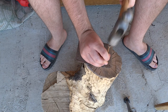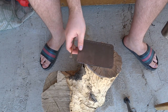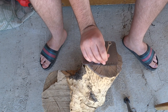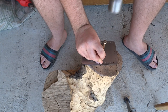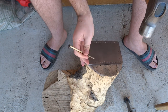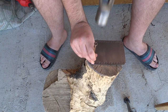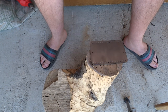After I cut the metal bits, I mark them and make divots where the mail would go in later on. I make divots so the drill head doesn't slip off and make holes centimeters off, because each hole needs to align with the mail and the other plates. So I need to be exact in this situation, and I make a prepared hole for the drill to go in.